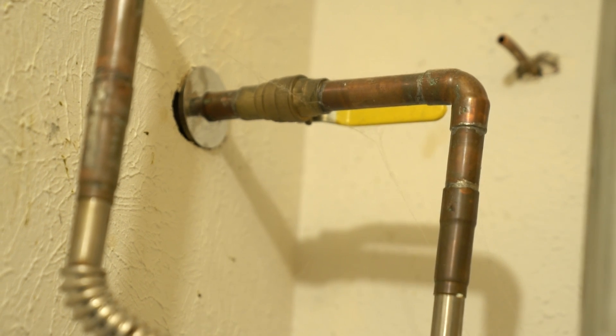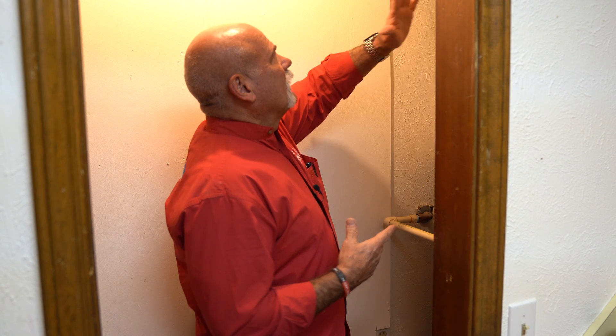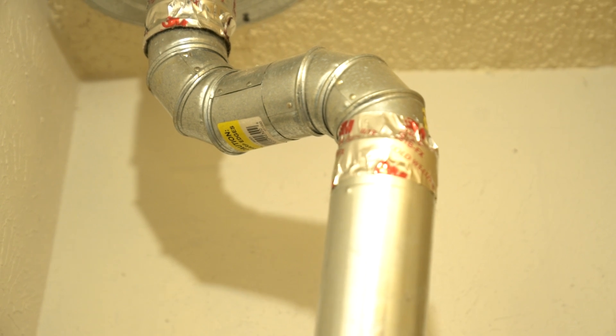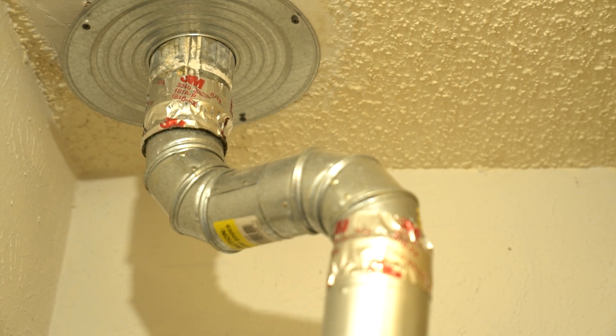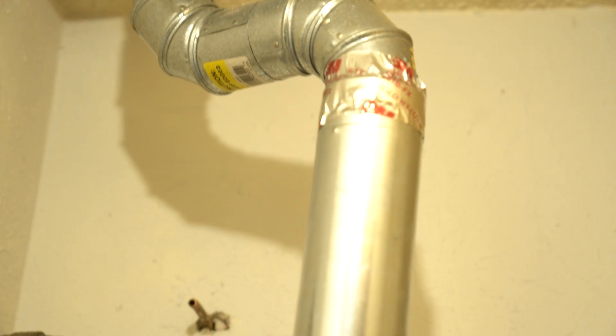I love that this one has a ball valve — so in case of an emergency, anybody can get in here and shut it off really quick. Just looking at it, I don't like the way the gas vent is installed. It looks like they just had a certain piece length of pipe. It does feel like type B vent, but it's got two 90s right there. I probably would have gone a shorter piece of pipe and put two 45s. That's something we'll change up here in the future.